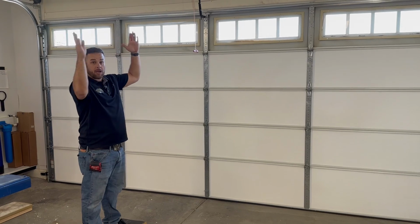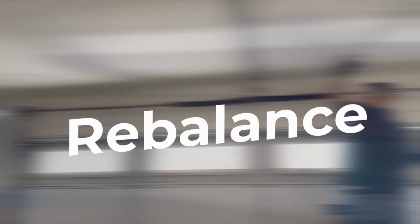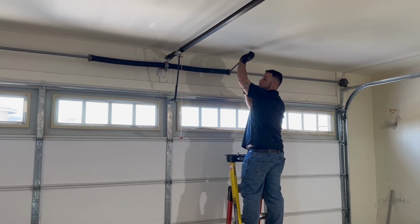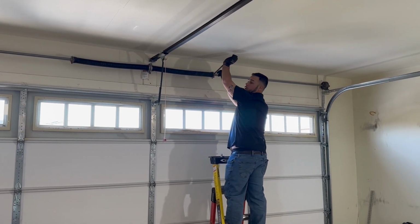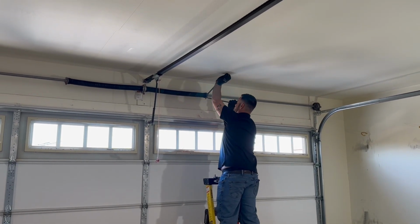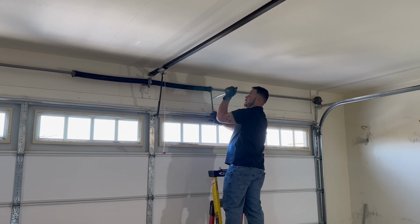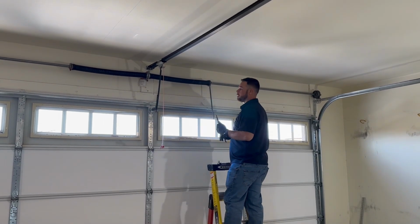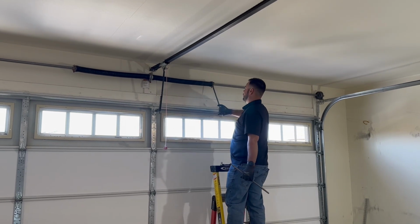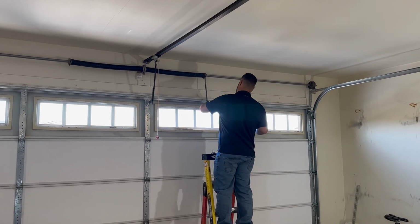Imagine that on the top end of it, and now the opener's struggling to press the door down. If you are gonna attempt to do this on your own, which I highly do not recommend, never put your head underneath the bar. Because that's where it's gonna take you out. Exactly. Is the bar always gonna be pulling down on both sides? Yeah, unless it's a reverse mount door, which is really rare. But you could see, you know, how much it's gonna catch right there. The tension is down here. And if it had momentum swinging, that would be even more dangerous. Hospital bound.